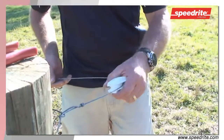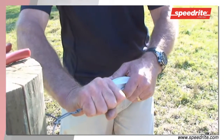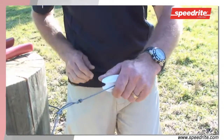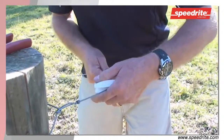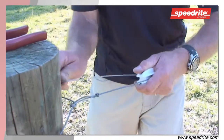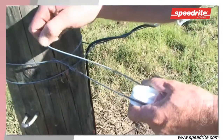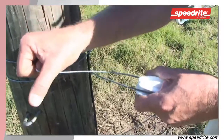When tying your in-strain insulator off to the post, use a fist length away from the post to make your tie point. Bend the insulator into position, create yourself a handle. It's really important that the insulator is tied straight in a direct line from the post.